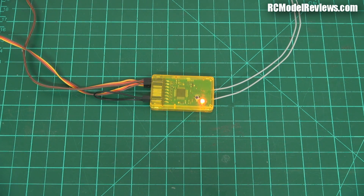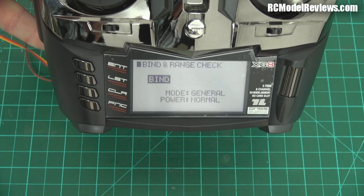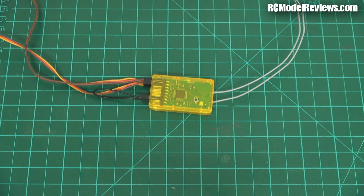It says red light on and green light off when searching for signals, and green light on and red light off when a bind is established. It says connect the shorting plug on channel six if using an XG7, and channel seven when used with other transmitters. Then connect the battery to the receiver and press down on the receiver's button while turning on. I did all that and it didn't work. Let's try it again just in case it was operator error. Back to bind mode in the transmitter — it says binding.